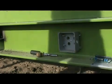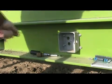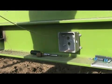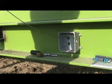Now you need to run the load cell wiring. Remove the cover of the junction box on the side of the scale. Then remove the circuit board. Run a fish tape through the conduit. Scales with multiple sections will require some conduit to be placed on location.